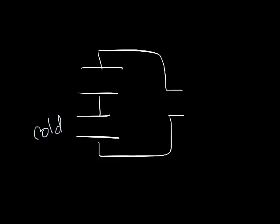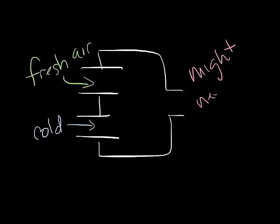One application that we're starting to see more of lately is the use of dual duct boxes that have a cold duct and a fresh air duct instead of a hot air inlet. This allows you to bring fresh air into the occupied space and measure it and meter it. Although dual duct boxes don't usually come with reheat coils, this application may need a reheat coil. We'll talk more about this in future podcasts.